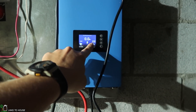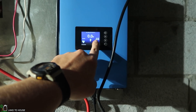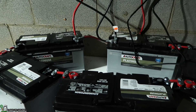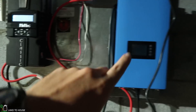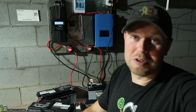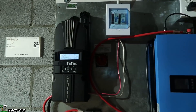The house is using 235 watts, and the battery bank is at 63 volts right now. Whenever the inverter sees that the batteries are at 72 volts, it will kick on and it will use power up until this 234 watts that the house is using. Once the batteries drop down to 62 volts, it will shut off the inverter, and then this will charge it back up again. Now, if I have enough power and the house is using less than this 180 watts, then the inverter will just pull off the top of the batteries and never discharge them below that 72. I'm very new to this portion of the micro hydro system. Spencer has been a huge help in getting this up and running. We are somewhere around 175 to 185 watts coming in. Let's go ahead and go down to the turbine, turn on a second nozzle, and we will see what the power jumps up to.